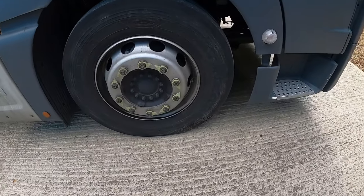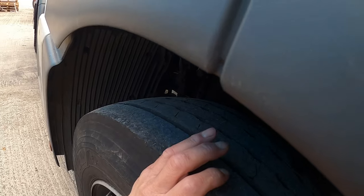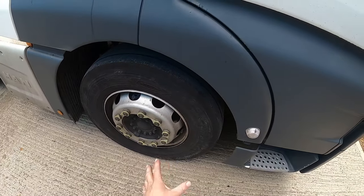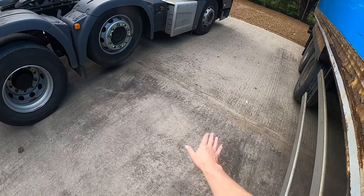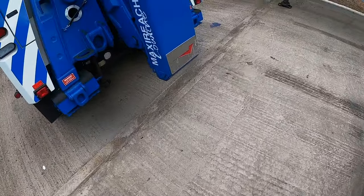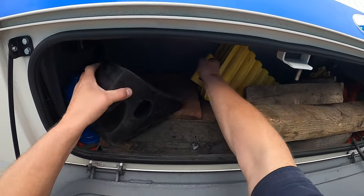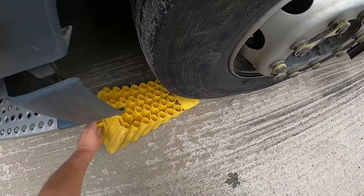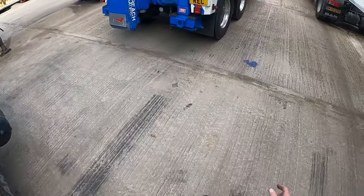My main thing first of all with these is to check that you've got two brake pipes going to the chamber. I put my hand down and I could only feel one, so we've only got one brake pipe going to the chamber. That means the handbrake is not working on the front axle, so we're going to need to chock that first before we think about trying to do a pre-lift. It's on a side slope so I might put a couple of chocks either way. We might as well do the job properly - if you try and cut corners on this job, even for something as simple as this, things tend to go wrong, so we'll do everything by the book.